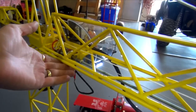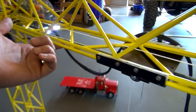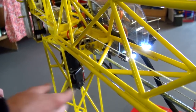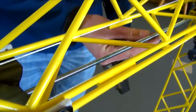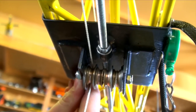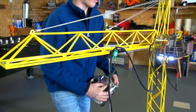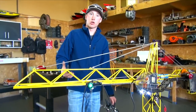Up to the front of the boom there's actually a 35-turn brushed motor with a carriage that slides up and down. How was this designed? This was designed on a worm drive system — I tried a belt drive and a rope drive and nothing really worked, but this worm drive is very very strong and resilient for a lot of weight. It's a very basic worm drive using quarter-inch threaded rod, and there's a long nut up top in a little collar. The nut is just being screwed on and off the threaded rod — back and forth. It's brazed into a pinion on the front right off the motor. Very simple, low maintenance, and strong.